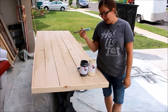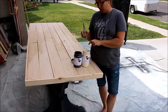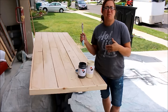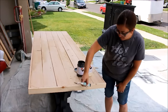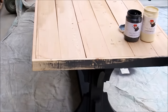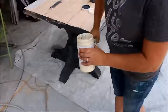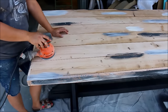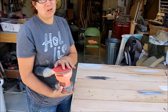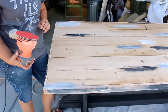We're almost to the end of our painting part. I'm going to be brushing with my round zipper brush in Gunmetal and Fresh Cream — taking Gunmetal around most of the edges and then sporadically brushing on the Cream and Gunmetal on the top in a few different spots. Later I'll sand it to smooth it in and then stain over the top. As always, if you want to buy Fairy Chalk Leather paint, go to jamierayvintage.com. For distressing, we're going to smooth out some of these edges from our brush strokes — in the end result you want to look like clumps of leftover paint, not something you just brushed on, and you want it to be super chippy. I'm starting off with 80 grit on my rotary sander, then switching to 150 to smooth everything out — 80 will leave it just a little too rough.